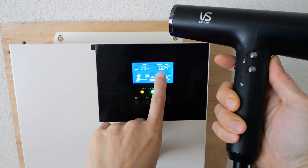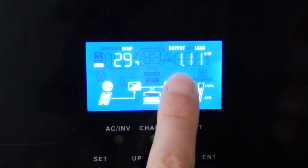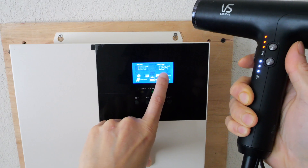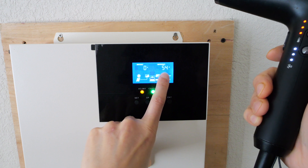I have a hairdryer over here to use a lot of electricity. If I turn it on — about 1.5 kilowatts, AC output 12 amps. You can see it stopped charging the battery and it's actually pulling energy out of the battery instead. Battery output is about 50 amps, then 30 amps.